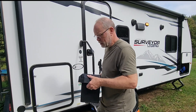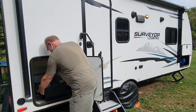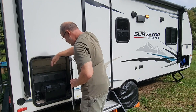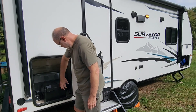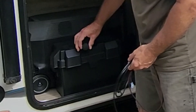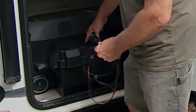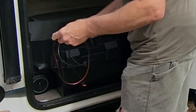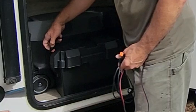I just took this out of the box, so you're seeing this as I'm seeing this. This is as far in as that goes — will this thing close? It's really close. The terminals are right up against this door, which tells me I really don't want the connector on the front and I don't have room for it on the back. So that dictates putting it on one of the end faces. My inputs are back here, so this XT60 will plug in back here and come around this side — I need to put my 12 volt receptacle in this end of the battery box.